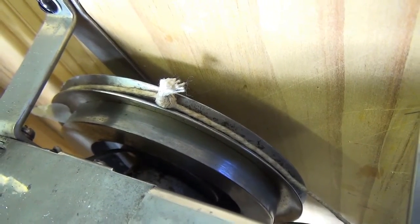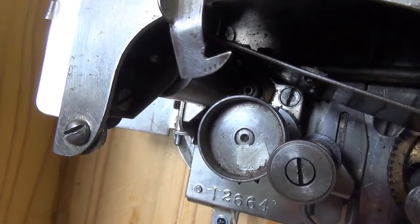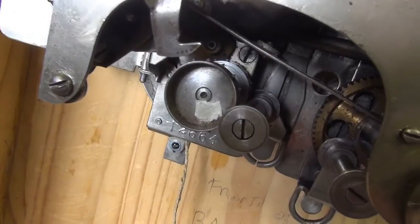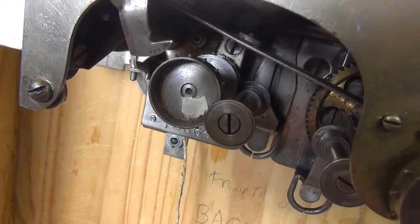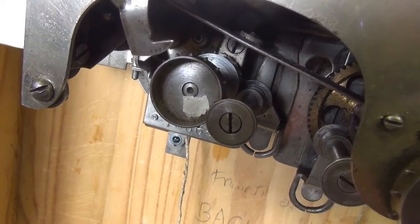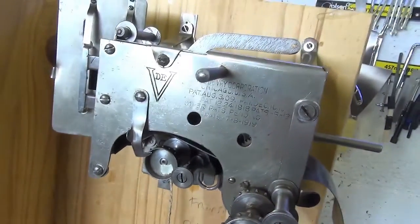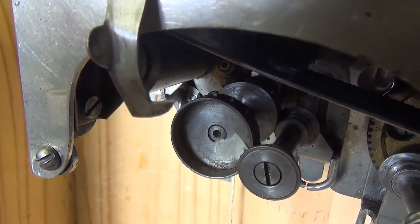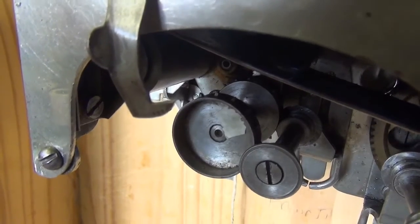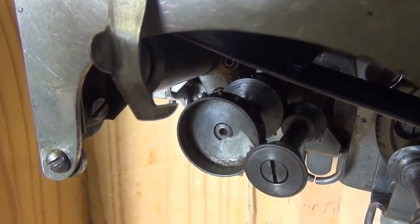I've just worked out the ratio between that pulley and the motor pulley. The intermittent sprocket, which I've marked up so you can see it turning, has 16 teeth, and there are four teeth to a frame of film, so it turns one quarter turn per frame. And that's exactly what happens — if you turn the big pulley, that sprocket will turn one quarter of a turn. I'm going to try and show you that now: one, two, three, four, five...